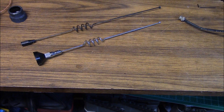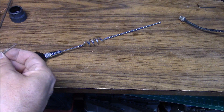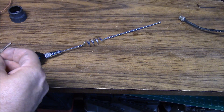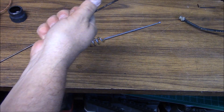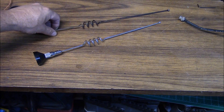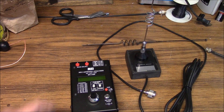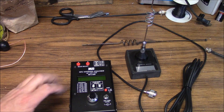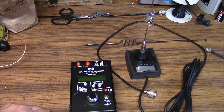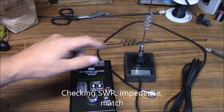What we're going to do is cannibalize the resonator out of this antenna here — you can see that is a longer resonator — and see what kind of interesting effects that has when used outside of its antenna band. For this test, we're going to use an MFJ-266, which does VHF and UHF. This is actually much easier to maneuver around than a radio when checking reflected power. We're just going to use a magnetic mount base and mount it on a vehicle.